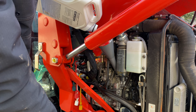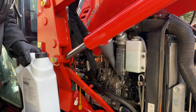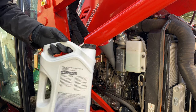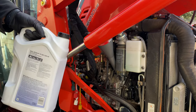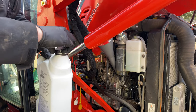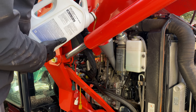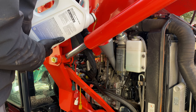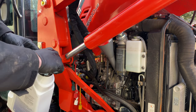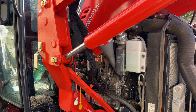This one's pretty easy with the plugs underneath and I had to empty it all out anyways, so it doesn't really matter. This says it takes 7.4 liters. Each one of these is 3.75 liters, so I need to go down to where there's about half a liter left and then check it from there. There's always some oil left in here, but with the drains being at the bottom it probably gets a good amount out, so it'll probably be pretty close to that 7.4 liters. I'm going to hold off on adding any more after this drains until I can check the fluid level, after we get everything back in the transmission.